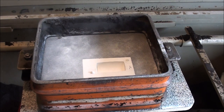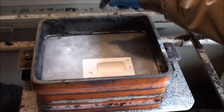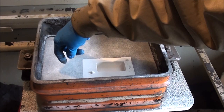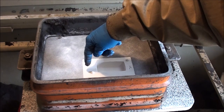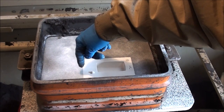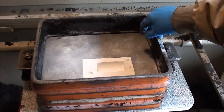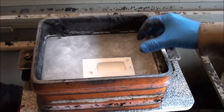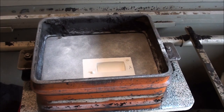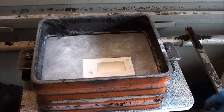I've got more parting dust on here. I did put the pattern off to one side so I have room here to work and put my sprue. I believe I'll put the sprue on this end, because eventually that's going to be the end that has the hole cut into the mold to pour the lead in. So there will always be some imperfections and I don't care if I get them right in this area. Also I'll have to cut two little marks in there so that I can grip the plaster and pull it out of the sand, because I cannot drill a hole in it for a screw or any other way to withdraw the pattern.